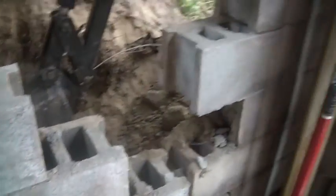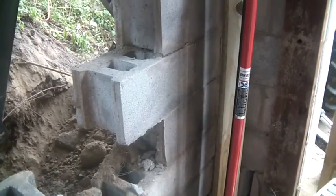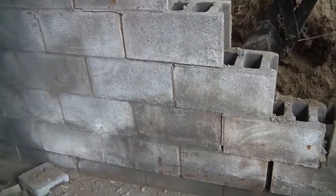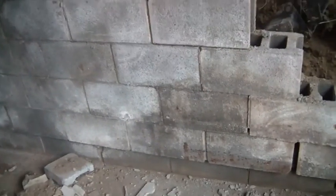After the corner is back up, reinforced, and ready to go, we're going to drop the house on it — or at least have the corner there. Then we're going to take this stuff down, finish digging behind it. It's easy if you just put the bucket of the loader right here, rake it a little bit with the backhoe. After he gets a couple courses up, gravel, pipe, and keep working our way back up — nice and solid, safe, proper, and the drainage is good.